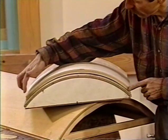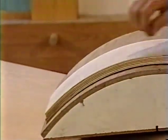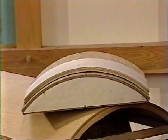Here's a sample I pressed on this form a few days ago with yellow glue. Look how it's touching on the ends, but there's a gap here in the middle. This is an example of toe-in. Rigid glues are your best insurance against these conditions. Rigid glues also have a much longer open time, which is usually advantageous on curved panels because there are multi-layers.